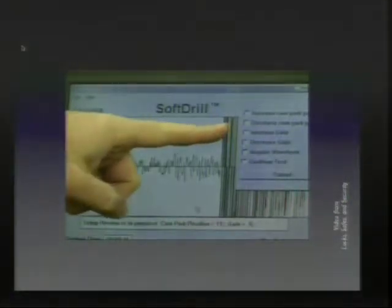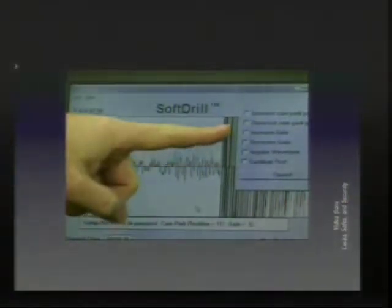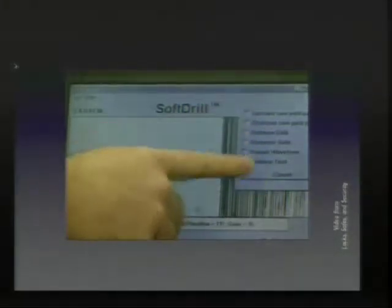That's a good setup. If I get a poor setup, I have a few options. I can move the microphone and try different areas on the safe, or I can actually adjust my gain, decrease the position that the drive cam is hearing the contact point. I can make some changes here, but I find that generally I don't have to do anything. So I will click on continue test here.